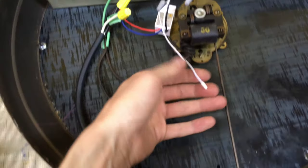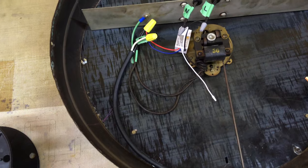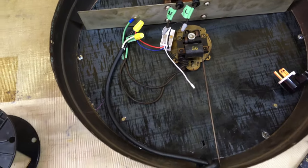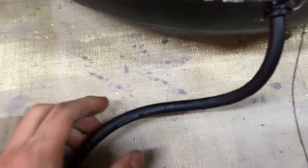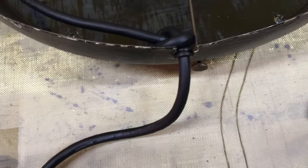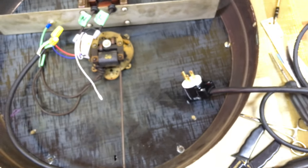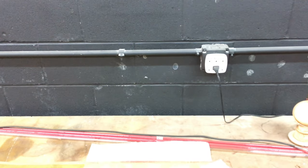I got the antenna for the switch hanging near the hole in the back, because I think this metal body is going to act like a Faraday cage, so hopefully the signal will be able to get through that hole. Got this nice beefy 14-gauge wire — 2.08 millimeters squared for our metric friends — and a plug on the end. I might end up hardwiring it into a conduit junction box, but we've got a plug on it for now. We'll plug it in and see what happens.